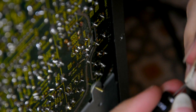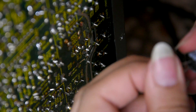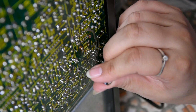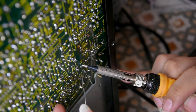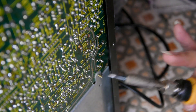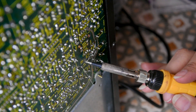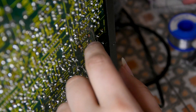Let's take this out. The time actually hasn't gone as much with the desoldering as it normally would with a wick - it's gone more with searching for the freaking capacitors. Let's try and make this cool and desolder from here backwards. I'm kidding! Why are you not melting? Oh, because the iron fell asleep - that's why. That's what I like about these Hakko irons, or the Hakko wannabe which I have, which is still a good wannabe to be honest. The soldering iron, when you don't use it for a little while, the temperature cools down and it goes into sleep mode - SLP. It's only got three digits so I'm going to say slap mode.